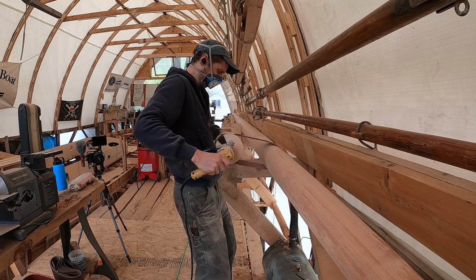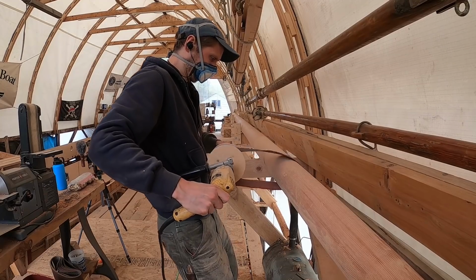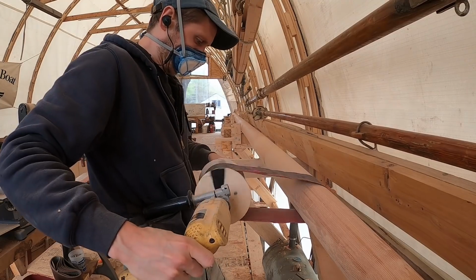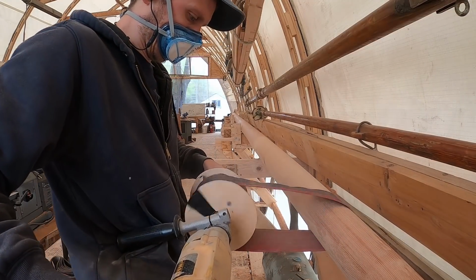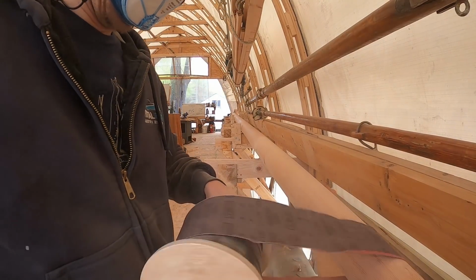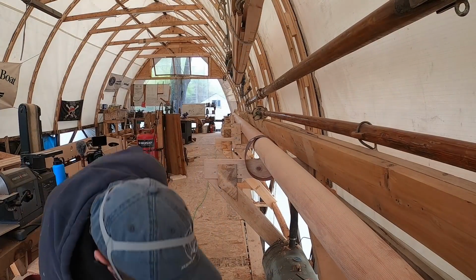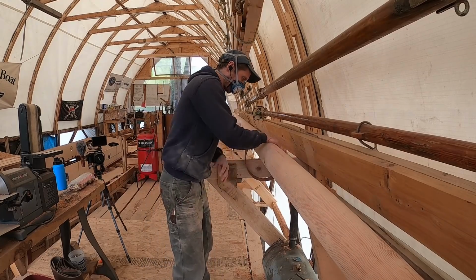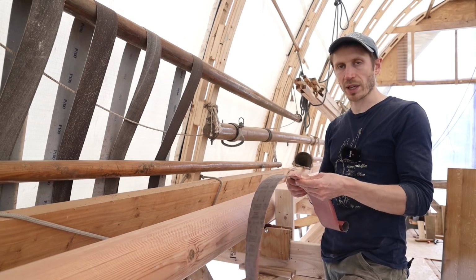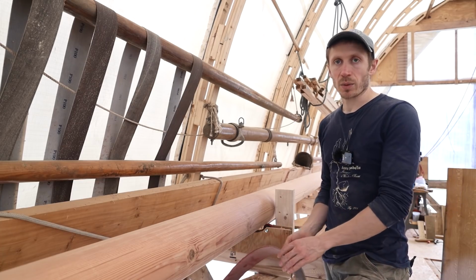And the sanding jig that I made, that sanding drum, actually works. But as I was working on the top of the mast up there, it was working well enough, but one, it was really tiring to hold and to keep the pressure on the trigger accurately. And the other thing is it would jump the belt. Even with the sides that I put on there, they're just a little bit too short. They were just circles that we already had cut out, so I figured I would use them. And what ended up happening is when the belt would jump, it would curl one of the corners, and that would make a hard spot, and it would start to dig into the mast. So if it's going to start doing that, it's not really worth using.